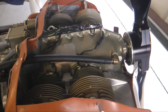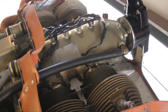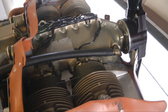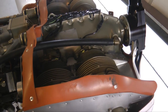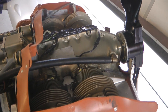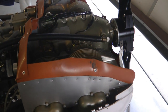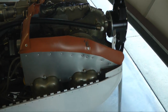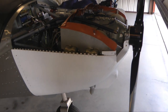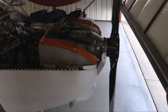How long does it take to get that kind of temperature differential — an hour, three hours? With this particular model of heater, I leave it on overnight to achieve that. About six hours or so is enough to get the engine to a point where it's startable. The hangar is heated and I keep the cowl under a blanket, so I get pretty good thermal performance. If you were in North Dakota or northern Minnesota and your plane was outside, not in a hangar, you might want the bigger system or a different solution. This one has served me pretty well so far.